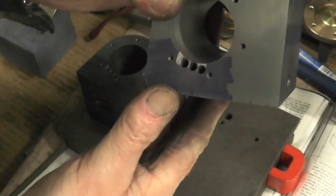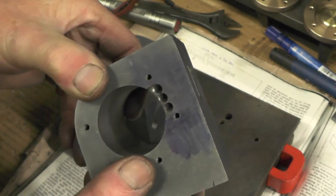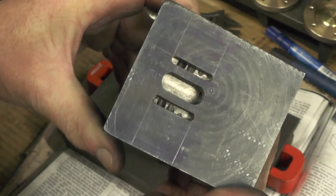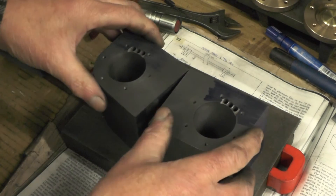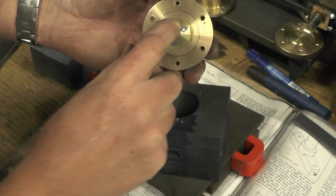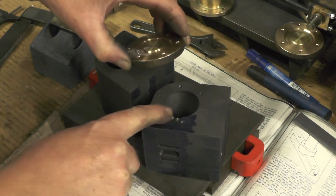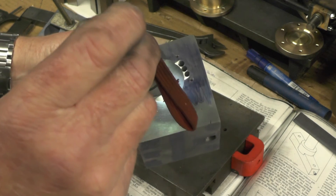That's it then - jobs are good and got them all completed now. Just one thing I overlooked when I did the covers: with this spigot you have to mill or grind just a little radius into this spigot to match up with the steam passages, so that when it's connected to the bore it just gives that bit of extra area for the steam to come through.